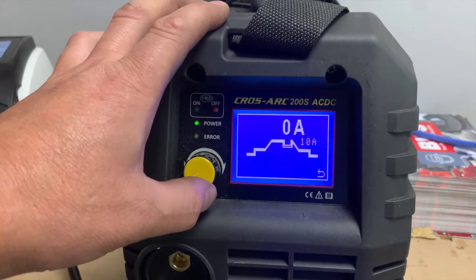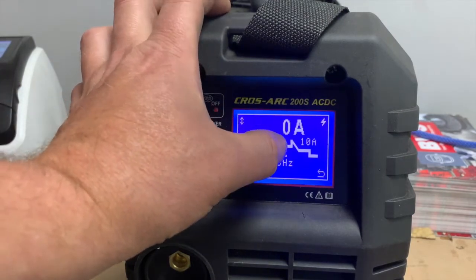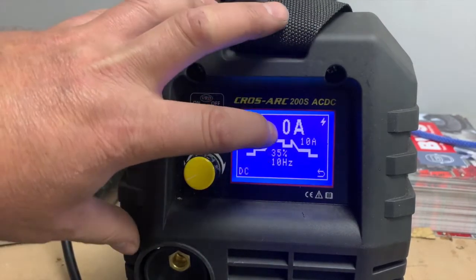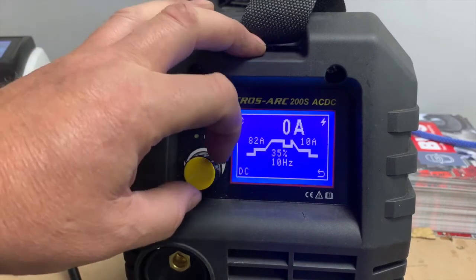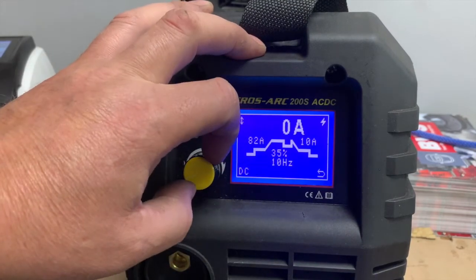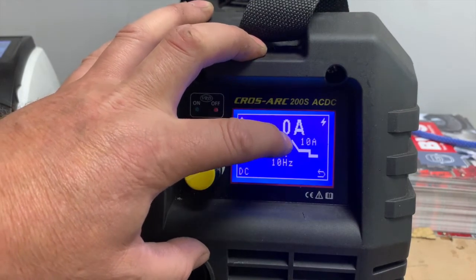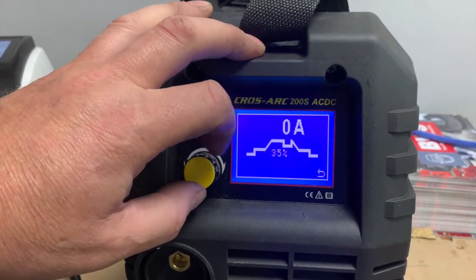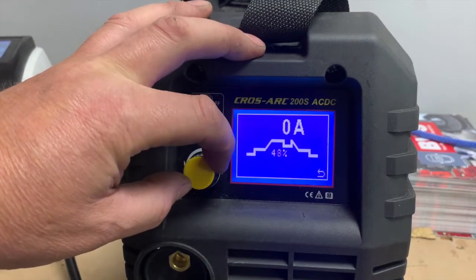Now, as you can see, we've brought on some extra settings. So this is your bottom current. If you can imagine, you've got high current, low current. And the welder is going to pulse between these two currents at a speed that you set in hertz. 1 hertz is 1 second. So obviously this is quite fast. So again, 35% is how much it spends in the high to the low. So I usually set this for 50. But if you wanted a hotter weld, you would set it 60, 70, whatever. But a nice setting to start with is 50,